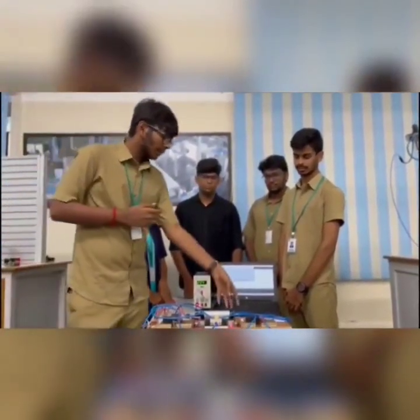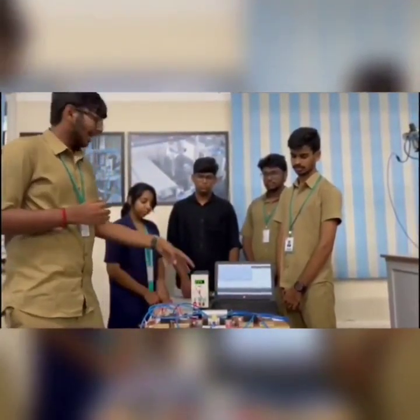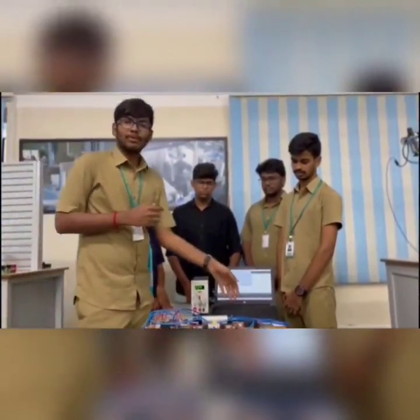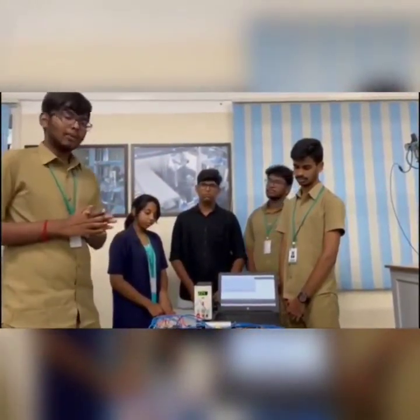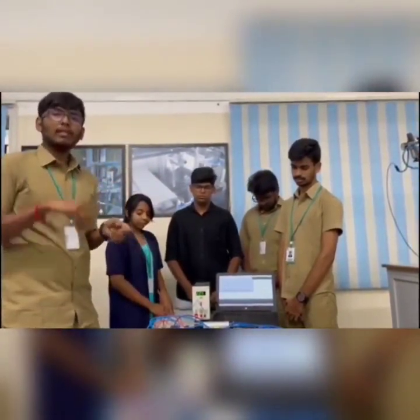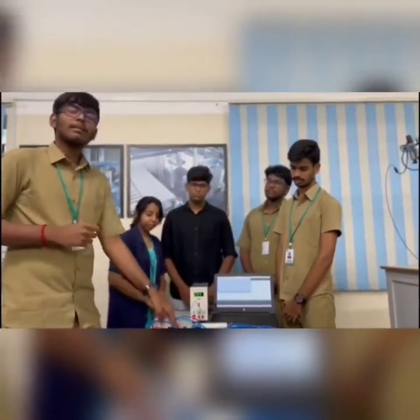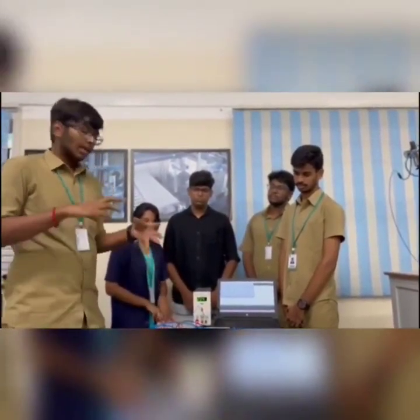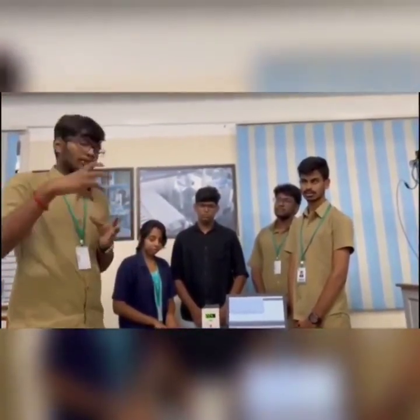So we have used a ball valve and servo motor arrangement with the help of an Arduino and relay to control the position of the cylinder. The main innovation in our project is that normally, for position control of a pneumatic cylinder, we use a proportional valve. But here we have added a servo motor and ball valve coupling arrangement, which replaces the work of a proportional valve.